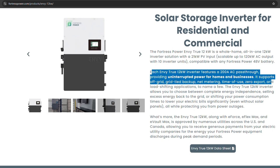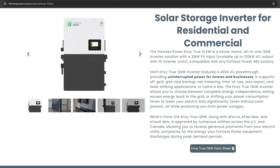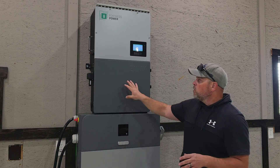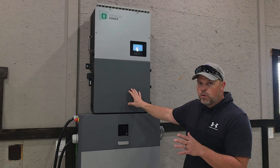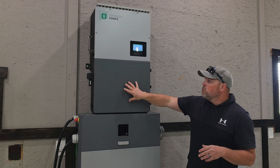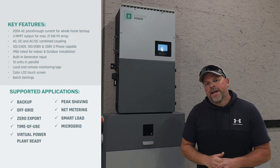You can connect your main wires coming in to this and then those wires going into your 200 amp service, so this can act as a bypass. That's very important because if you're going to use this as a backfeed into the grid, there are so many different configurations you can use this for. You can use this off grid, on grid, solar only — there are a lot of different configurations, but just know that you're not limited to what I'm showing you today.